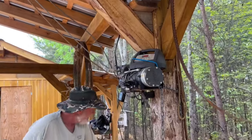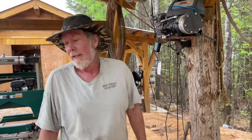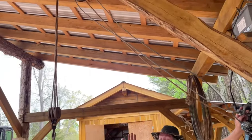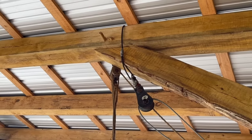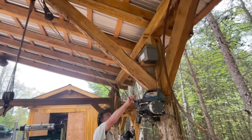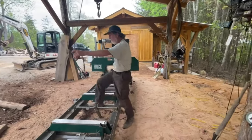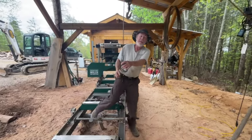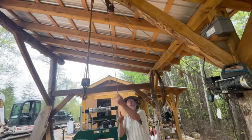The very important part of the design is that I made the structural integrity strong enough to hold the logs I'm going to mill. The centerpiece is an eight-by-eight white oak, and I built a knee brace system exactly where I wanted my winch handle to be. Some guys have it in the middle — we don't transport our logs that way. We're focused on getting them on, turning them, and being able to secure them while working alone, so mine is positioned towards the inside for two specific reasons.